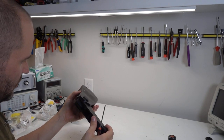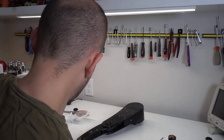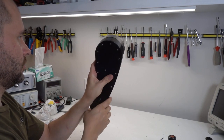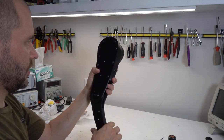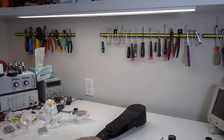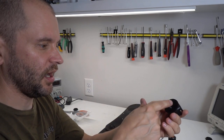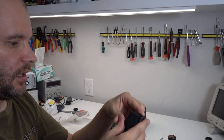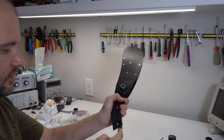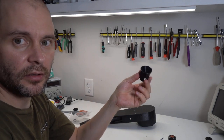That moves freely. We still have to figure out why the belt isn't quite moving as freely as it should — there must be something mating on the upper pulley. But now we'll make a stab at putting a foot on it. We have a leg right now; we'll start by doing the foot, and then once we have a foot we can work on the upper joints. The foot has this plastic piece, which is a solid infill part. What we'll do is epoxy a squash ball onto it, and then this will mount onto the bottom just with two bolts, which will fit into the inserts we put here into this lower leg piece.